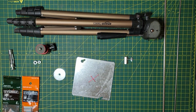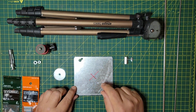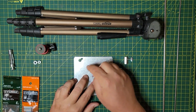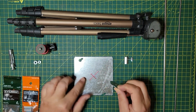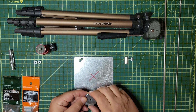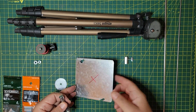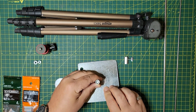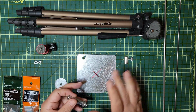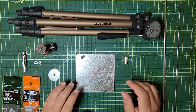Now once you drill a hole, and when I do this on the video, I'll show you guys, you need to deburr the hole, and then if you're going to mount this, you're going to want to put this right here, mark around it, and then scuff up this and scuff up this with your Dremel so that when you use JB Weld, put it on there. Same thing. Once you compress this, and we'll put it on the back, obviously you have to take that off, scuff everything up, apply JB Weld, let it all dry, then you put it together, boom, you have a launch pad. It's really simple to make.